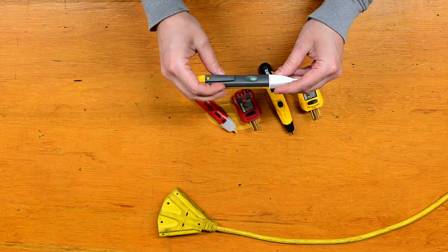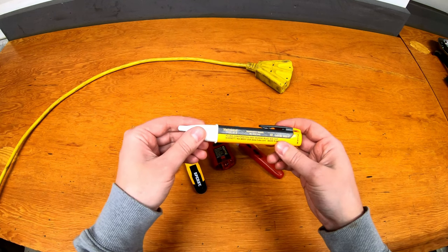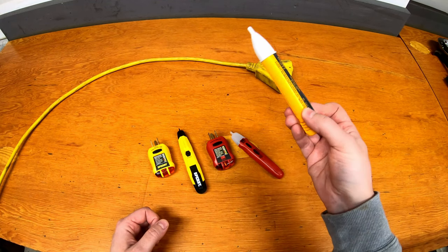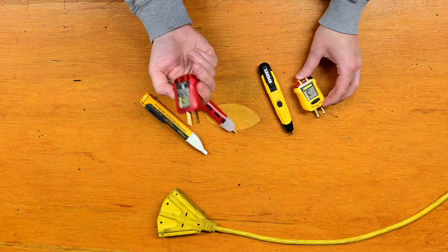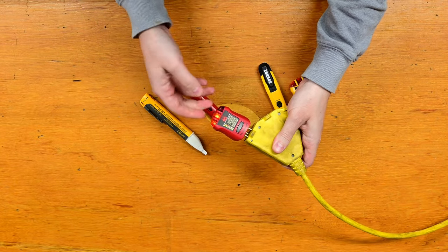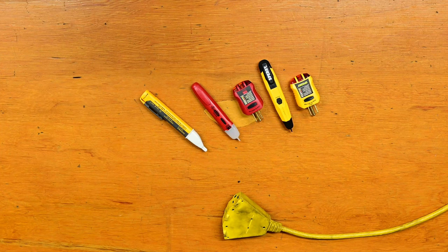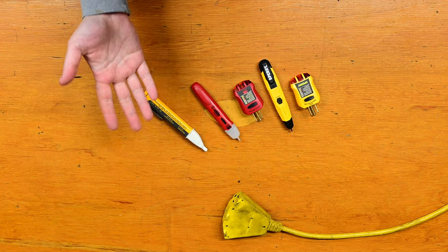The other type here — this one's from Fluke — does a detection on a line, but it's more for tracing wires. So within an electrical panel where you want to find one individual wire if it's hot, this one you have to get a lot closer and it'll narrow in on the individual wire. The other thing I have here are circuit testers — a simple device you can plug into any outlet and it'll show you if it's correctly wired or not. They also have a built-in GFI test capability so you can test if a ground fault outlet is working. Very handy and they bring an element of safety to the work as well.